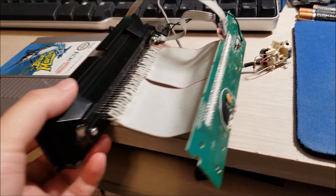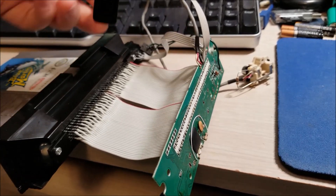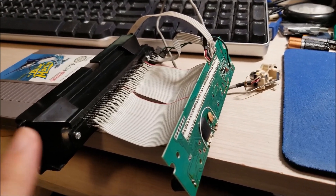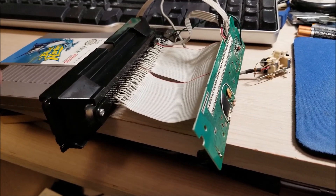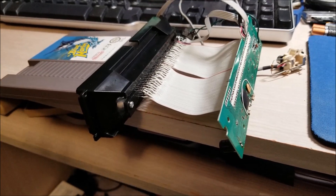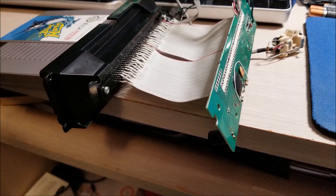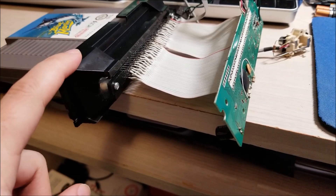Hopefully you guys enjoyed the look at the design process. This is already pretty much all wired up — I just have to wire the reset line, which is going to be controllable via the microcontroller. So that button on the front is a single button that'll control both power and reset. To turn it on, you press and hold, and it'll turn on after about three to five seconds of holding so it doesn't accidentally turn on. Once it's on, a single short click will reset the system.